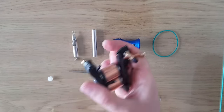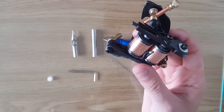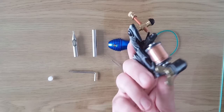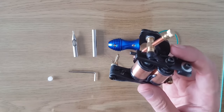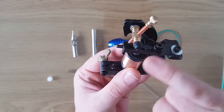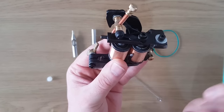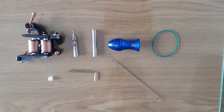As you can see, I've got a coil machine. This is one of your more old school tattoo machines, which I prefer using. You can get all different types — rotary machines and that — but these are very simple, good machines to use. This is a liner machine. You can tell because the bar pin here is a lot further back. If this was a shader it would be a lot further forward, which gives you a bit less vibration, meaning you can get a nice shade. The liner runs a lot faster.